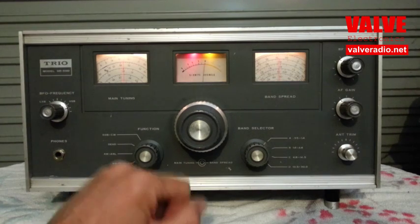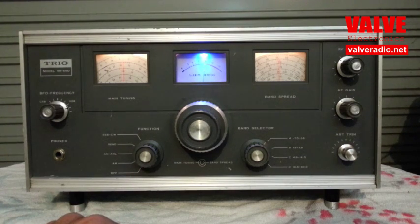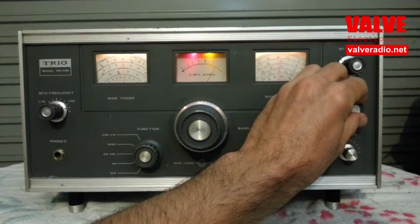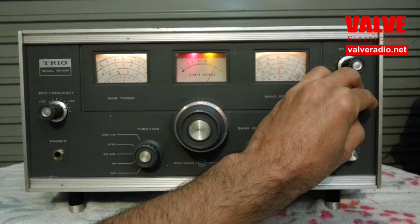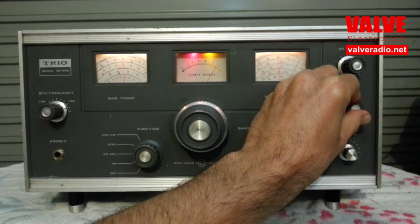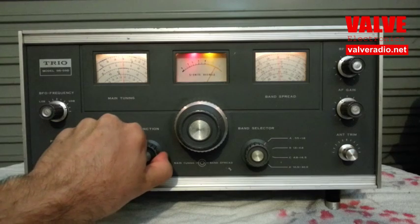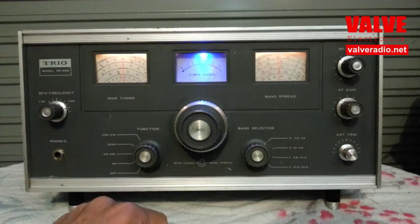This is the amplitude detector — the difference is quite dramatic. Here is another example with a station playing music. The radio is detuned and in amplitude detection mode — the sound is very distorted. When the synchronous detector locks on the carrier, the sound becomes very crispy and clear, like FM again.